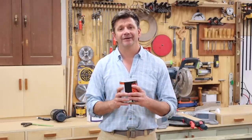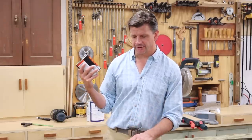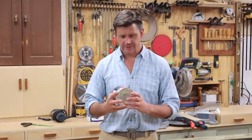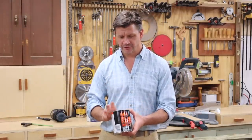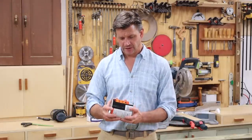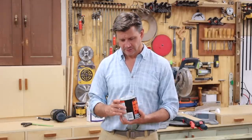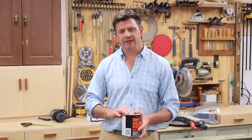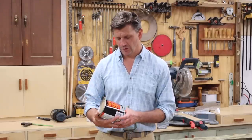The last thing I want to talk about is wood fill, because I didn't talk about it on the project. Ready Patch isn't a sponsor of the show, but it is a product that I've been using for at least 20 years. It's an oil-based wood fill. I use it on all of my exterior projects. It dries relatively quickly and sands pretty well. It doesn't shrink. I don't feel like you have the shrinkage problems that you do with some exterior wood patch.